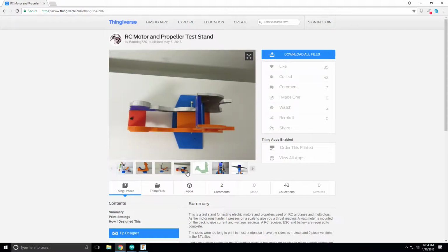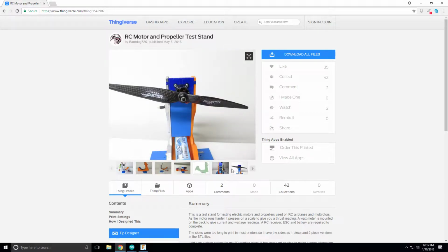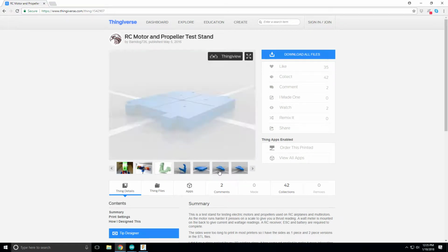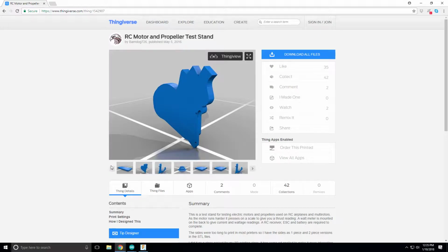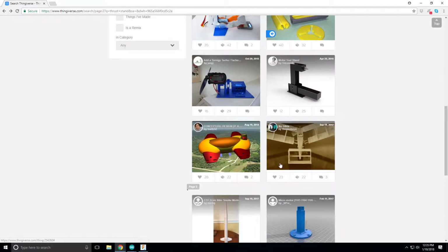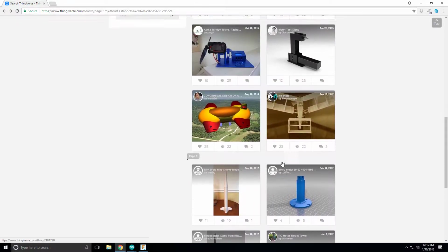And so here he has a whole bunch of stuff. He's got a 2200 battery in there, and I don't know if he's got a servo tester. I think that's the servo tester. But having the servo tester on there is probably a bad idea because you're touching it and now it's causing weird ripples and stuff. But he also puts an ESC in there. So then eventually we're going to change it to a brushed and brushless capable thrust stand.